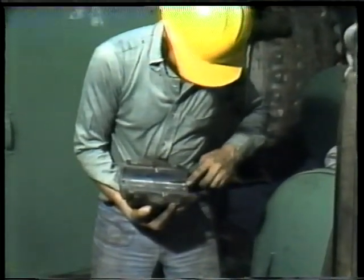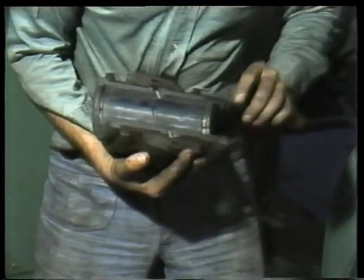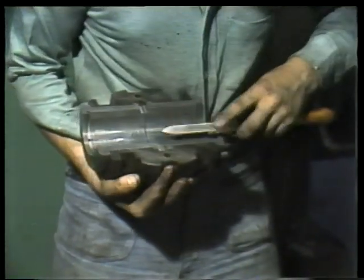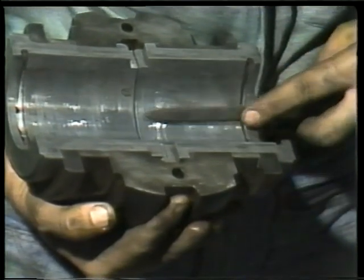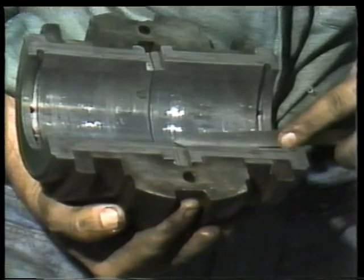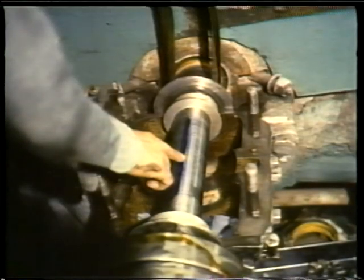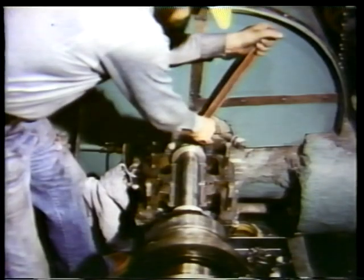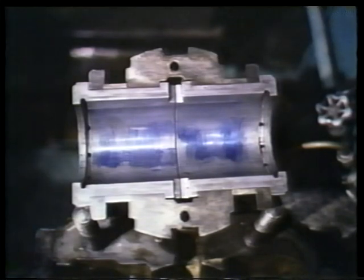This job is done with a tool called a bearing scraper — they come in all shapes and sizes. To make the bearing fit the shaft, you scrape the blue places, the high spots on the bearing. This can sometimes be a pretty time-consuming operation. Since this is only a demonstration, we'll cut it short and repeat the test so you can see what a good result looks like. After applying the Prussian blue, rotating the shaft, and rolling out the bearing, here's what you should have: a nice, even coat of blue over the shaft and the bearing. At least 80% of both surfaces should be blue. If this is what you come up with, you've done a good scraping job and the bearing is ready to go back together.